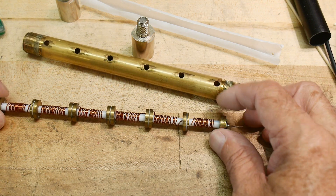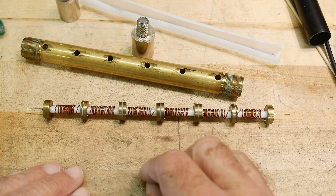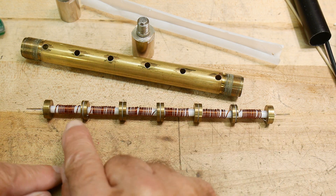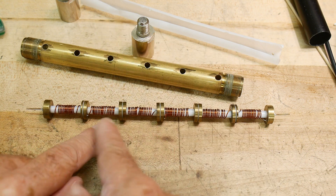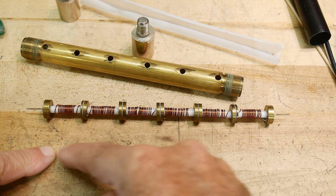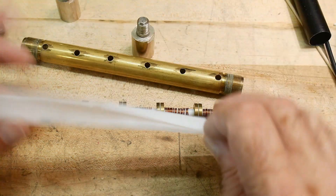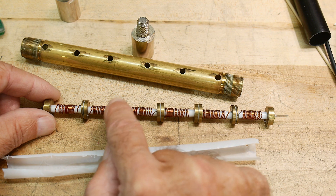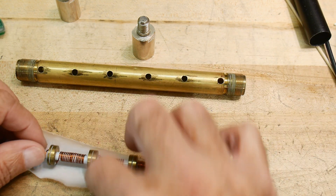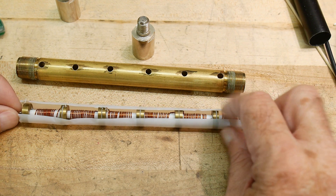So what's going on here? We have inductors obviously — filters are inductors and capacitors. Where are the capacitors? The capacitors are built in: they're these discs, and these discs are spaced from one another with plastic in between — some type of dielectric. That sets the capacitance. This is like a pi network — there are L's and C's. The C's to ground use this dielectric, and it's the capacitance between the outer diameter of these discs and the pipe. The pipe is ground, and the capacitor is the capacitance between the brass and the brass. So this is just a super cool filter.